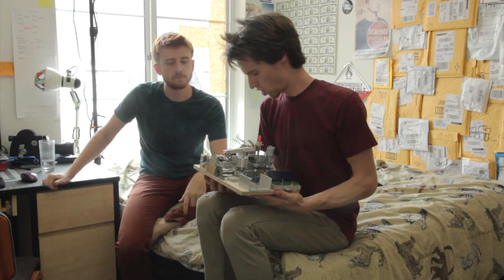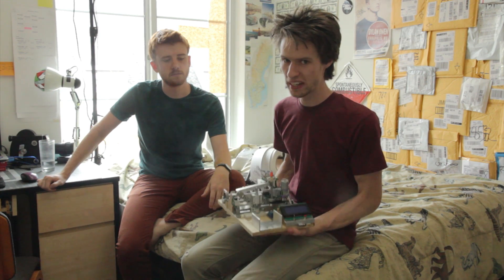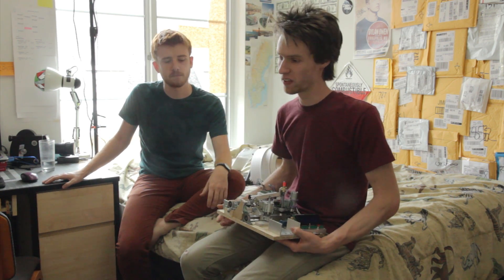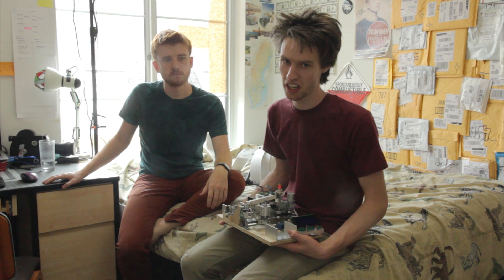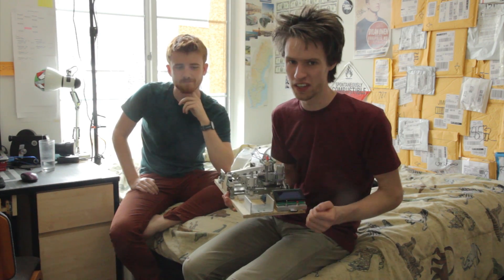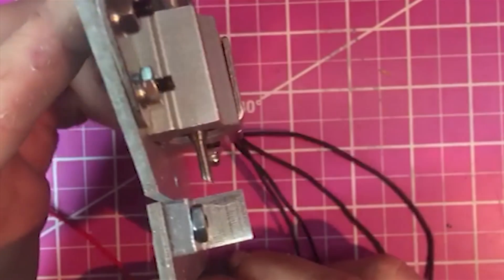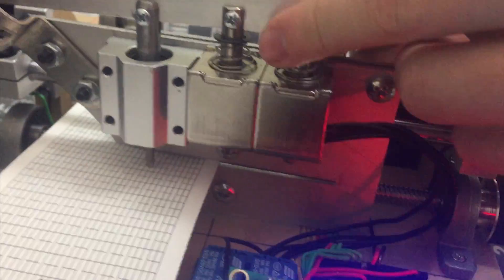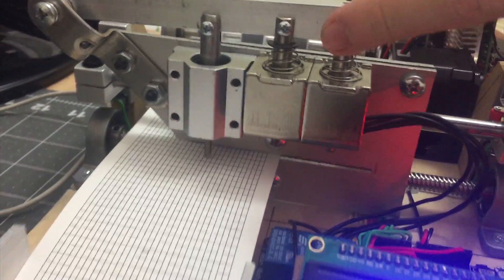I say it works. It seems like it works. So here it is — we are a little bit late to the party. This problem was already solved about a week and a half ago by a team of people who made it work for not a laser cutter but a vinyl cutter. That was pretty cool but we still want to show what we made. What was very hard — way harder than I thought — was getting the hole punch right. We went through a bunch of iterations. We tried it with two solenoids pulling a lever down with a punch machined on a lathe, but the holes weren't clean.